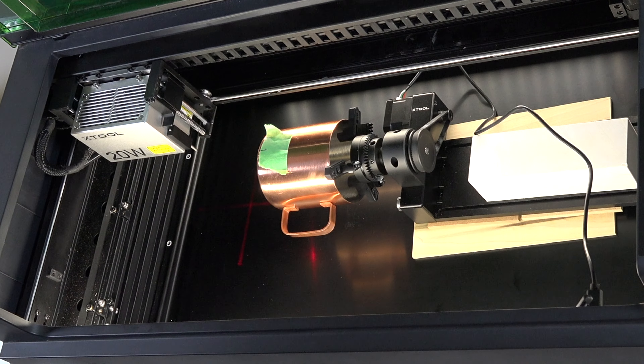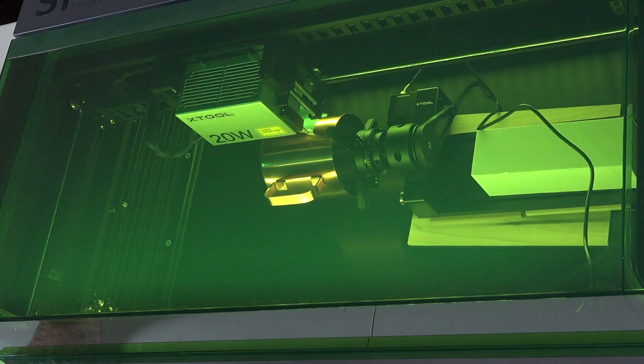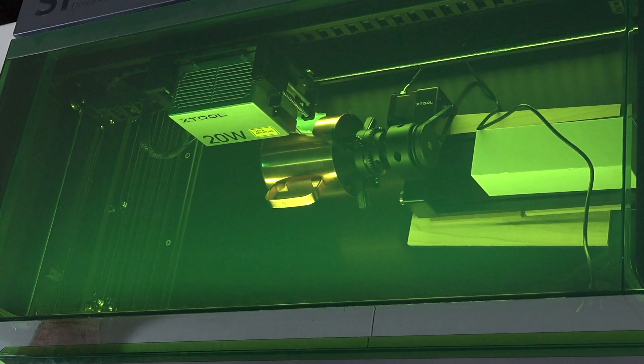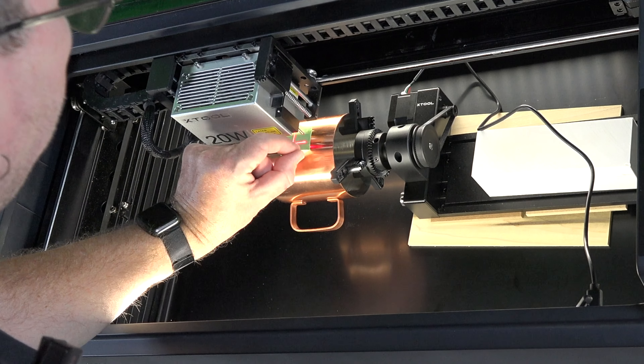Then slide your laser to the right — don't move it front to back — and if that laser line lines up with your marker line you have the right setting. I'm going to shift the masking tape just a little and try to engrave on it. We'll set it at 100 millimeters per second and a power of 80 percent, just to check orientation. And our test burn burned properly.